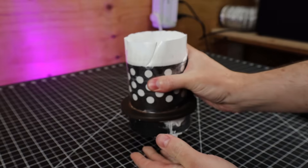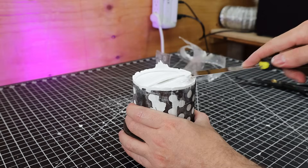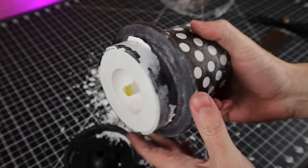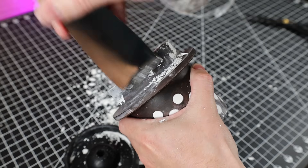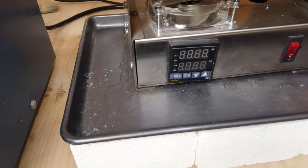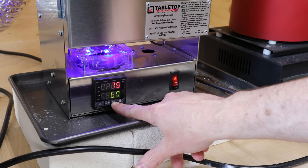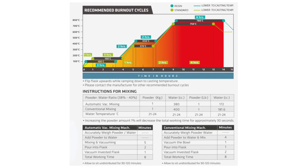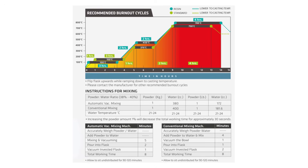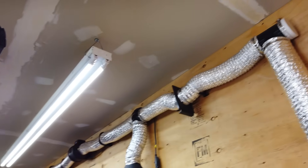After about 3 hours, everything should be completely hardened. Remove the tape from the outside before putting it in the kiln, since it would just burn off and make fumes. Scrape off any extra investment using a flat scraper, and don't forget to remove the rubber bottom, since it won't survive the high temps of the burnout process. It's finally time to put this in the kiln. I'm using a very small kiln — if you get one of these, make sure to put something underneath it, because melted wax and resin tend to leak out. I'll start the burnout cycle I programmed in, which ramps up the temperature and holds it at certain points for set amounts of time. I'll be using the standard burnout time for this investment, and I'll break down both the standard and resin burnout schedules for you. I have a simple ventilation setup because you're going to be burning stuff off, producing smoke and fumes.